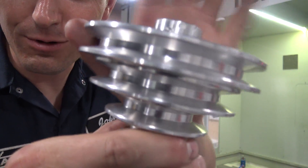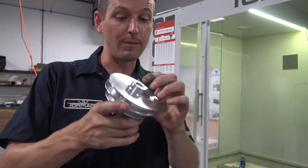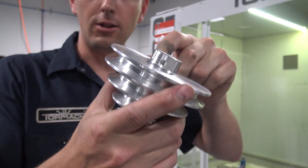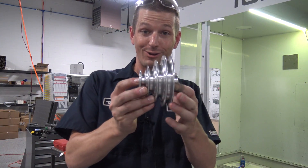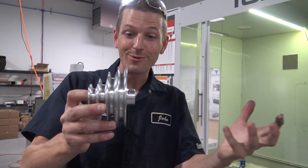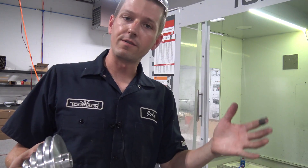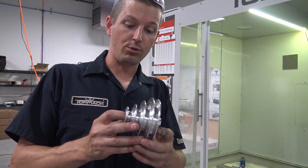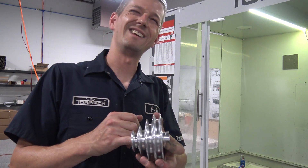There's the set screw hole and the broached slot — and that's a wrap folks. Some good takeaways. I'm really ticked that I screwed up the look of that boss right here — that's just not good. But we did it. I nailed the ID on that boring bar, which is pretty tricky, and it's just a really cool looking part. I'm still a pretty new lathe guy and if I can do this, you can do this. We took a piece of aluminum and turned it into this beautiful pulley. From a job shop standpoint, I underbid it — we try to bid $75 an hour, sometimes up to $100 an hour depending on the risk and type of work. This was expensive in my opinion and the customer didn't have a problem with that.